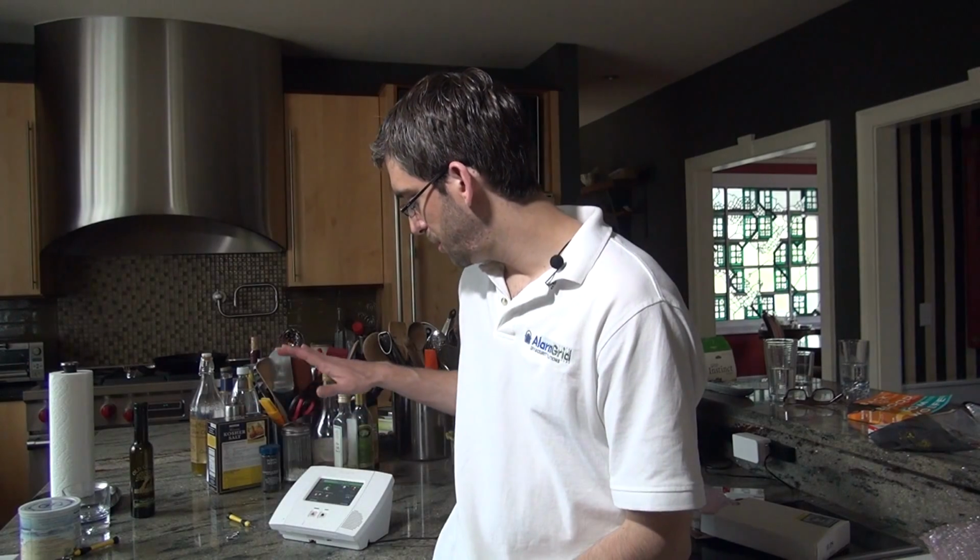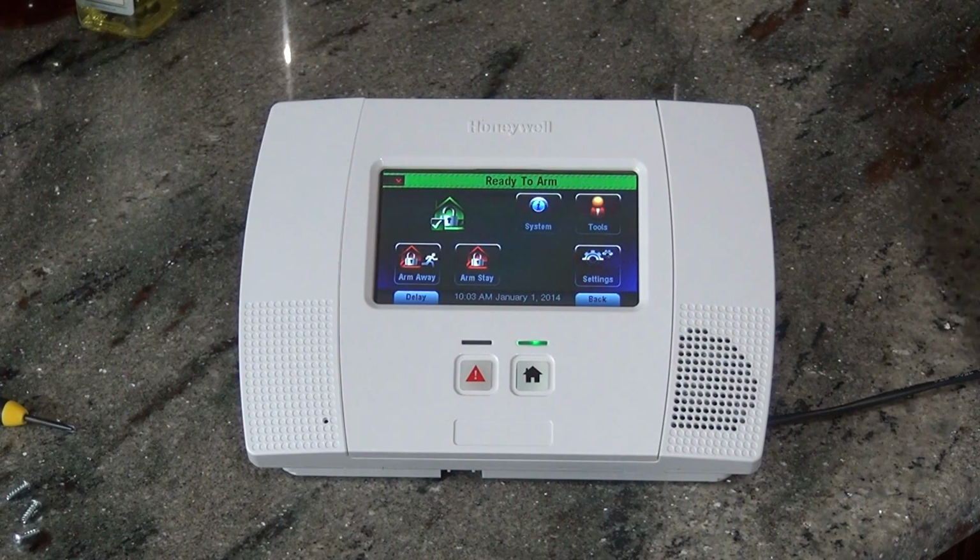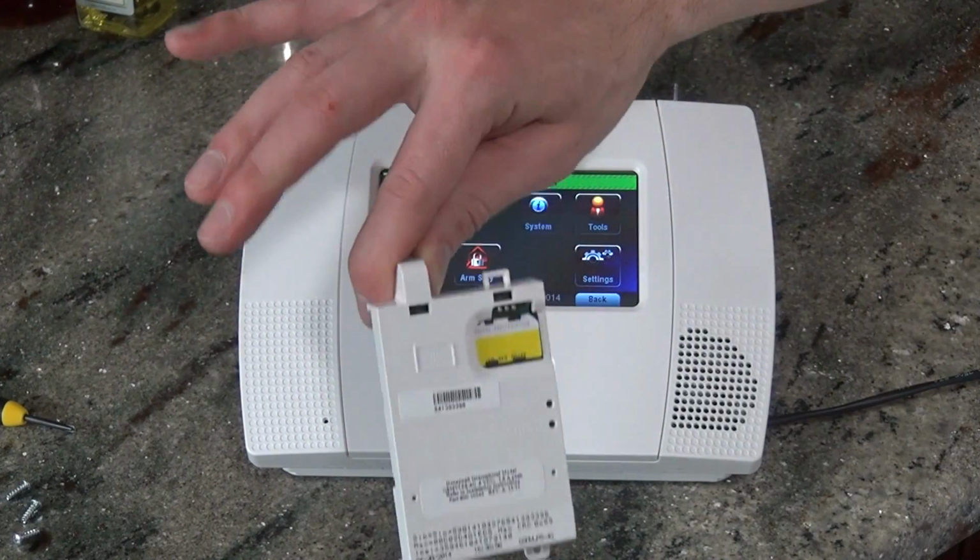If you go with the ILP5 internet communicator or the L5100 Wi-Fi communicator, both of those will rely on your internet service. So where your security system has a battery backup, if you're only using the internet for monitoring, then your router and your modem may not have a battery backup. If you have a power outage, the alarm will go off, the signals will go nowhere because the internet is unavailable. Also, internet cables are normally exposed on the outside of the house. Therefore, they're open to line cut issues. If the criminal cuts the line before they break in and internet is your only path, your alarms will not go out. Finally, if your internet service provider ever has a glitch, if you ever have to reboot your router, if they ever have to reboot things from their server end, your alarms will not go out when the internet service is unavailable. So that is why people opt to add the GSM as a backup cellular path. It's more secure, you pay a little bit more, but it's better security.